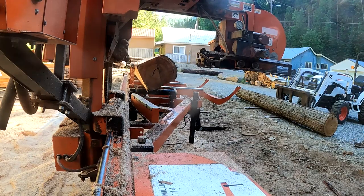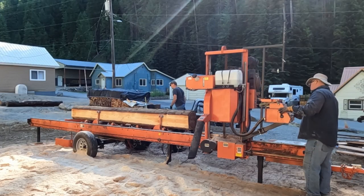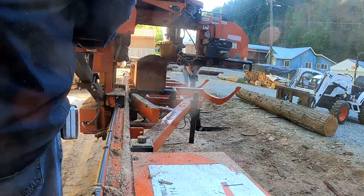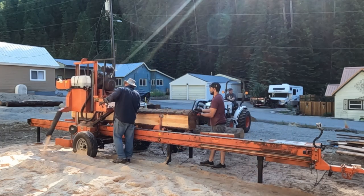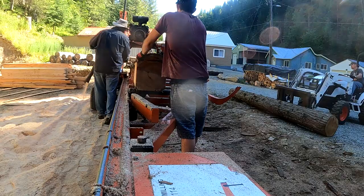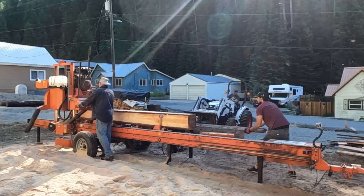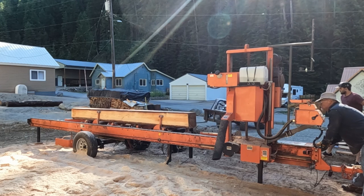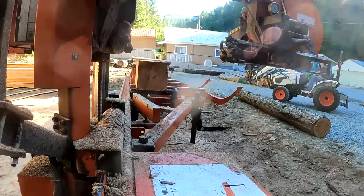If you do, it will cause problems in the lumber that it's placed in. So it's always best to box it in. We call that boxing in the heart. When I split this log, one of the things I'm always looking for is to make sure that once I get to my cant height, I don't drop down. In this case, I'm going to set it at 12 and an eighth of an inch, and I'm going to drop down to 6 inches so that I'll just take the kerf out and have 2 6-inch cants.